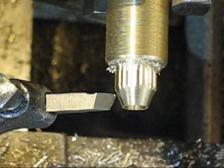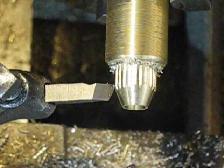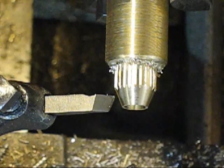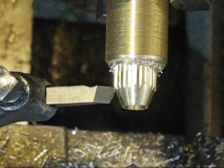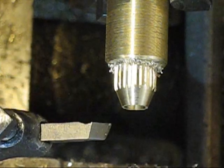Looks like I got this one and one more. Yep, right exactly where I thought. So I do have an even number of gears out there like I thought. And now all my little knobs are evenly spaced. Make one last cut here. 20 thousandths. So here we go.